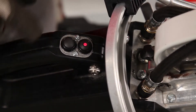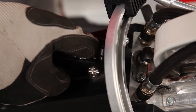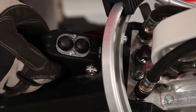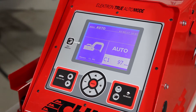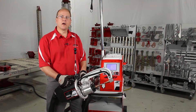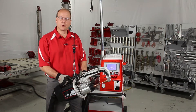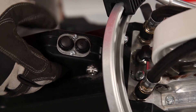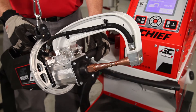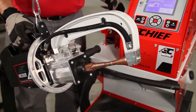If for some reason you have an incorrect weld, the bottom button will light up red. Pressing the bottom button will allow you to reset the system without having to come back to the machine, and you're ready to reproduce that same weld again. While in auto mode, after 20 welds, the system will ask you to recalibrate without any material between the two electrodes. Simply hit the top button again without any material, close the clamp, and allow the system to recalibrate.